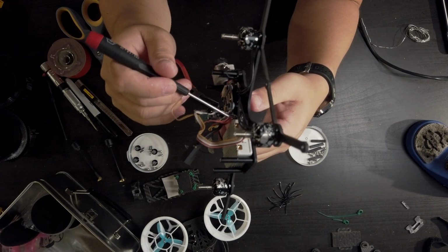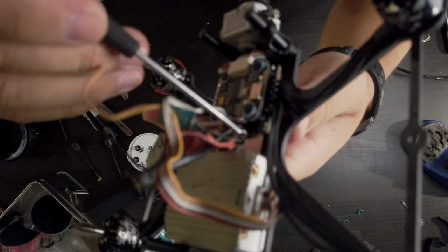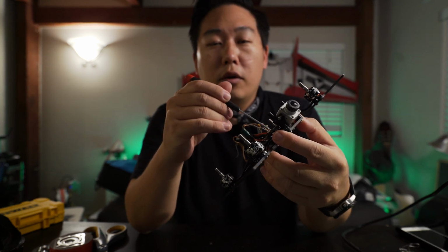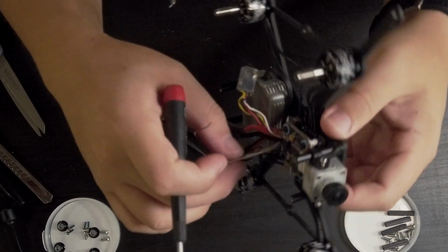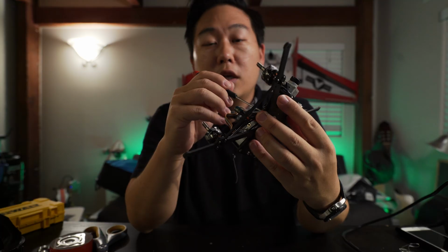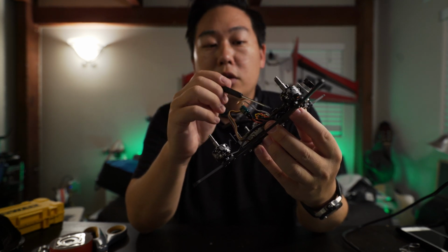I don't think you can see it, but basically I have wired it straight in. It's back here. Maybe you can see it. I have Crossfire hooked up to the S-Bus port, obviously running CRSF. And then we have the telemetry, which are these two gray and white wires that come from the DJI FPV system. And this connects to a TX-RX communications channel onto the Betaflight board.